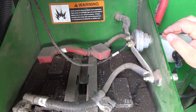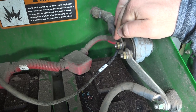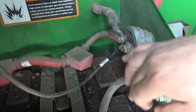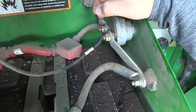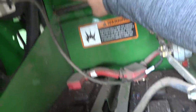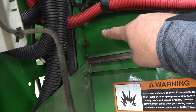Another big thing you got to remember is you want to ground to the battery switch, and it's got to be the inside pole — so when your switch is off, you're not still grounded to the battery through the other side. Make sure that you're grounding through the shutoff side of the negative post of the battery switch. Lots of guys are grounding right to the frame on bolts, and that is not a sufficient ground and it is causing trouble. So make sure that you ground right to the battery switch.